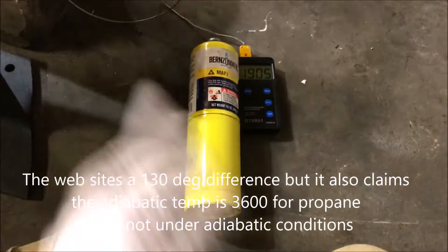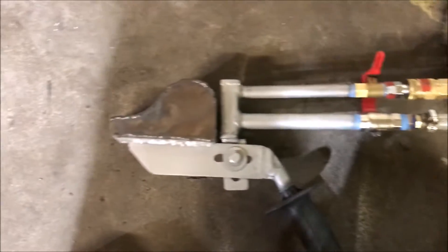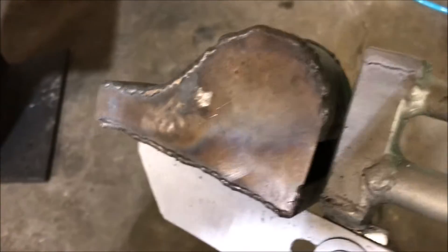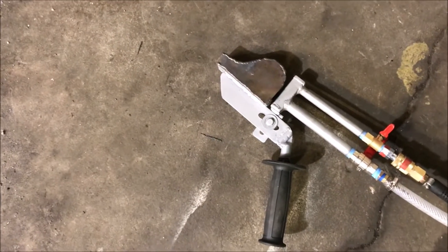I've always wanted to know, and now you have it. I recently got a comment stipulating that these burners perform just like a spud burner — just your typical burner, nothing special here to look at. So we'll put that to the test today and see if I can actually get a hotter flame. I know this flame is going to be a little bigger, but the size of the flame isn't really indicative of temperature all the time — you could have a bonfire that's not as hot as an oxy-acetylene torch. So we're going to look at the temperatures of the Hand Dragon on propane. This is a compressed air assist preheat torch that I've been selling, and we'll take a look at the temperatures it can crank out.